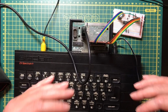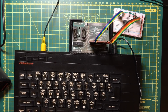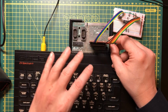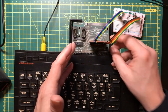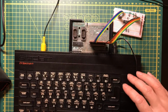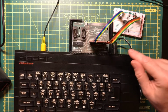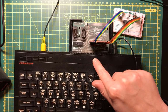I think it's time to tell you one of my long-term goals for working on the Spectrum. Okay, so there is an incredibly simple set of lines coming out of the cartridge socket, and the more complex things, such as what was done on the SNES to allow coprocessors and additional graphics support to be added to the system, that's just not possible on the Spectrum, or at least that's the traditional belief. You've only really got the wires necessary to fit a ROM in. Now, some enterprising people have managed to extend the system very slightly by creating custom triggers to allow switching in multiple banks from a larger ROM.